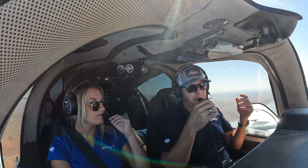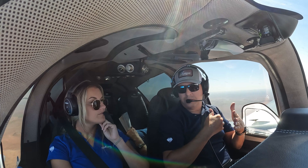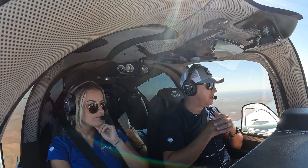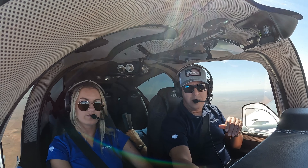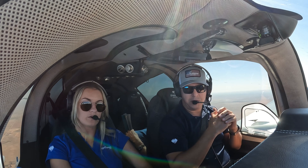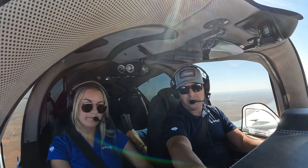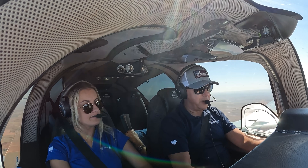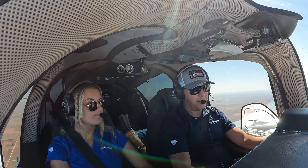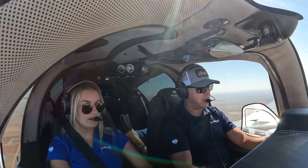If you don't run the TKS system often enough, you run the risk of drying those sponges right out and they'll crack. It's good for them to stay supple. You can also see the endurance levels that that amount will give you in hours and minutes. For full — there'll be 36 liters in this tank when it's full — you'd get three hours of endurance on normal, an hour and a half on high, and about 45 minutes with both pumps going on max. Those have different flow rates.